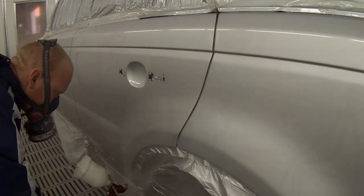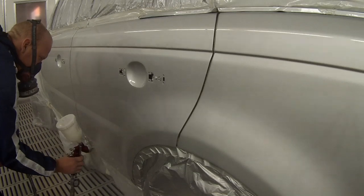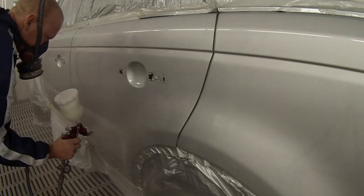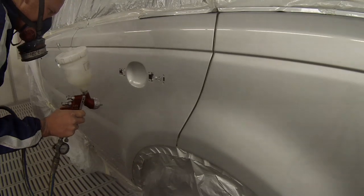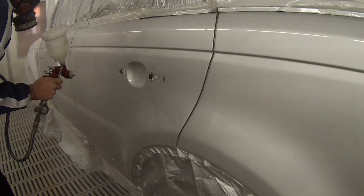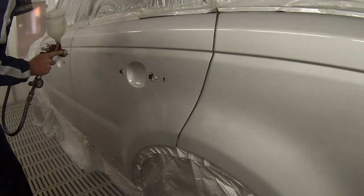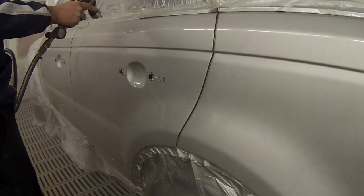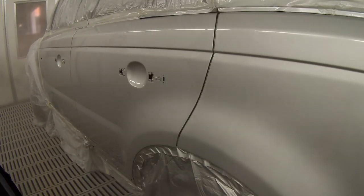This is the second coat. Take note of when I'm actually painting through these gaps — I don't actually stop at the gap. Something I used to do was stop at the gap itself but I ended up finding you can get big build-ups. So just here you can see painting just through that gap and then you do a bit of a flick out. I'm not actually pulling the trigger off — I hold the trigger down. You can flick it out with just a little bit of a flick on the trigger, but it's not necessary if you do the flick correctly.